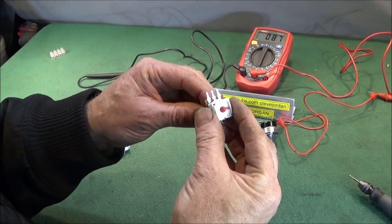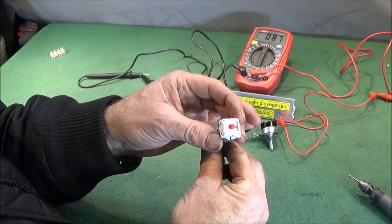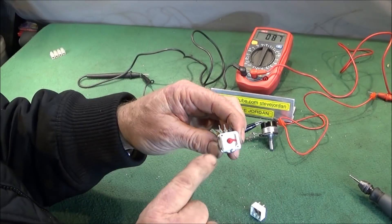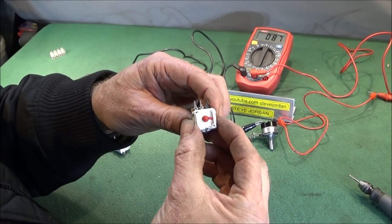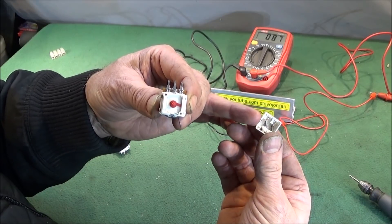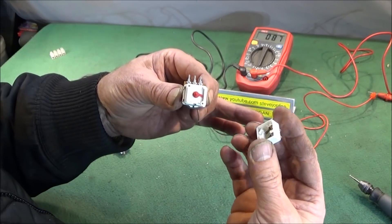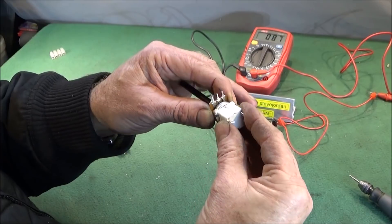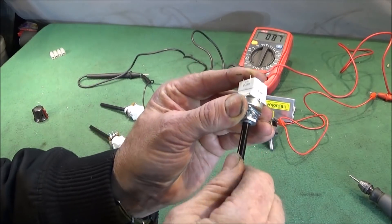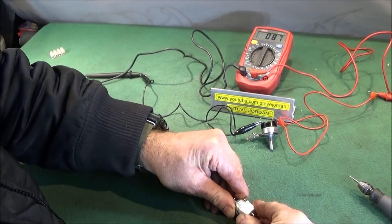When it's ready to go together, put the spindle in the fully anti-clockwise position. You can see the solder pins there and the red tab is pointing that way. Make sure the switch is in the new contact position with the points touching the actual contacts, then carefully put that one on. It should pick up with that slot - you might just have to joggle the spindle a bit - and that's working. Then push that one together.